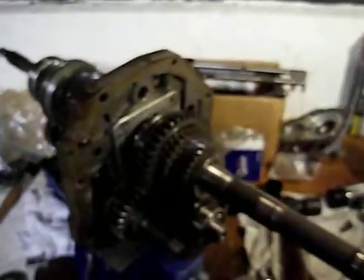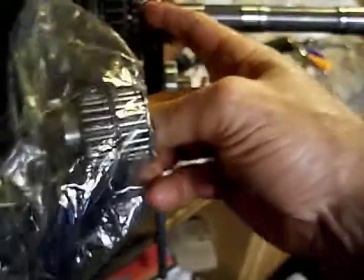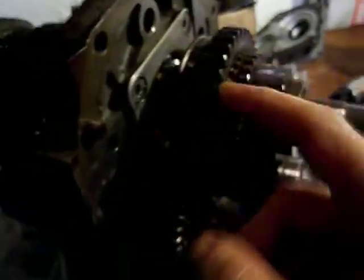I'll be working on that later, but I just want to do a brief description of exactly how I put the rest of this together. There's a sleeve right here that fits underneath this gear, and in the sleeve is a needle bearing — I replaced it with a new one. That sleeve is a press fit and basically presses up against a synchro hub.